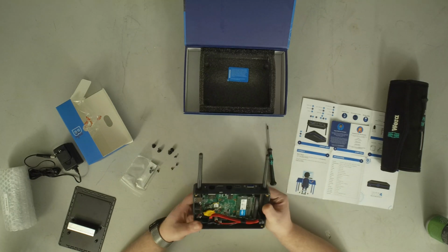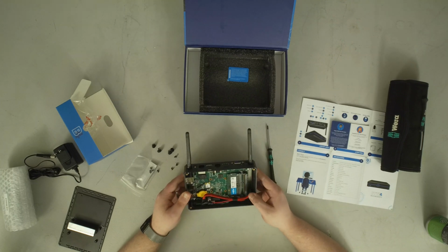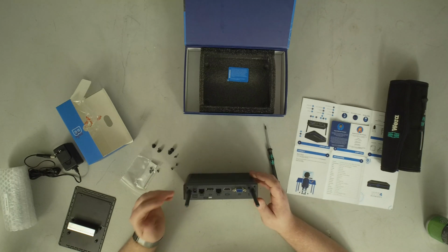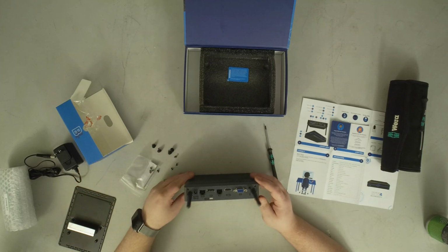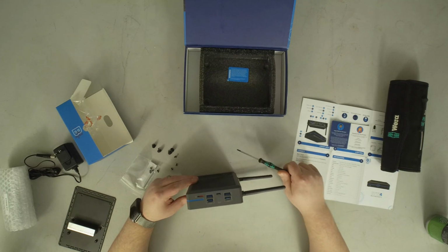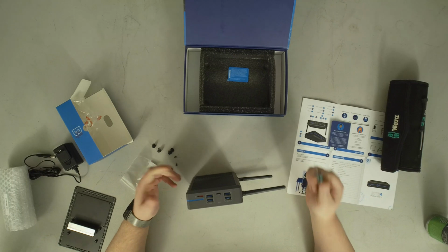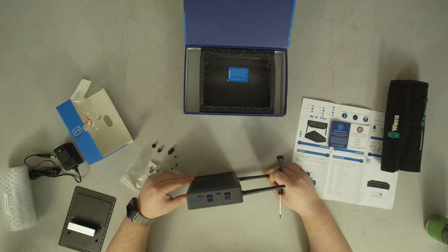I mean, there's no fan, there's no moving parts. We've got PoE power. I'm going to try pushing a little more power through it, and the reason that I mentioned that is the USB ports on this are capable of delivering more power out than that 2 amp brick is capable of delivering. So we've got some pretty high power USB Type-C devices that are capable of pulling 10 watts of power on their own. And then I've got some other standard USB devices that will pull 5 watts on their own.